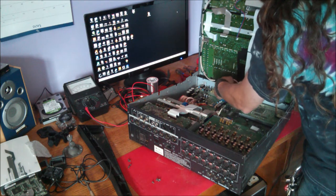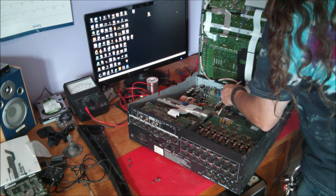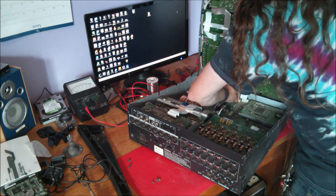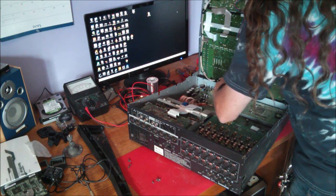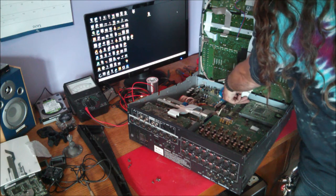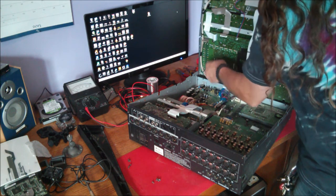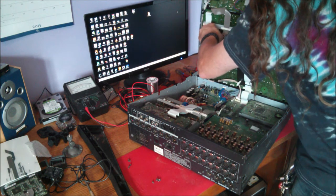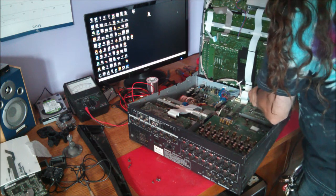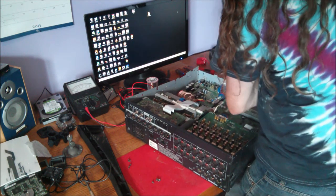Connector itself. Best thing to do, I would suggest, is to take a digital camera and take a good picture of everything before you start pulling cables out. And little ribbon cables are fairly simple as well. One there, one here, and that should about do it. Bingo!